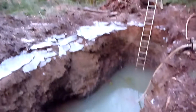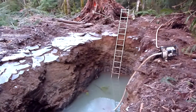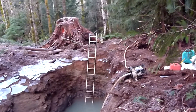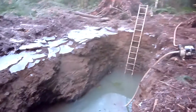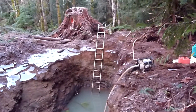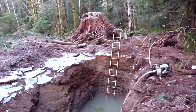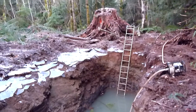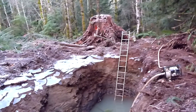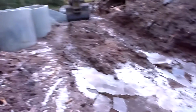Good morning, we're working on our well again. As you've probably seen in a couple other videos, it filled right back up to the top. We've been working on pumping this out — got a head start on it last night, pumped down quite a few feet yesterday, and got here early this morning and fired the pump back up. It's come down about four feet in about 45 minutes, so hopefully by coffee time when my equipment operator gets back, he should be good to go.